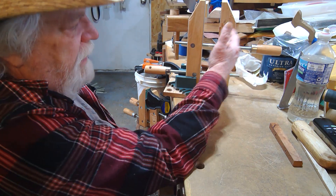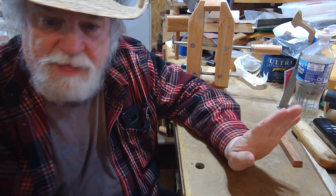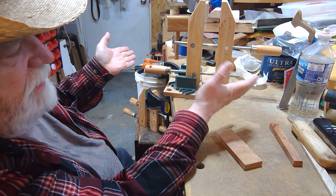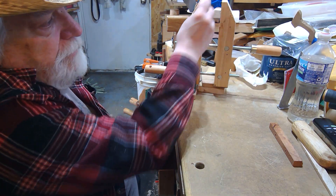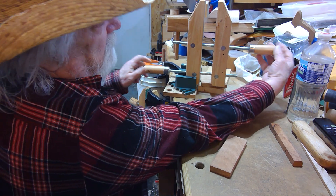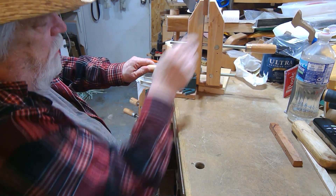Remember the two-step decision: before you move your knobs, ask yourself - am I adjusting my jaw, in which case turn them both the same direction? Or am I just tightening and loosening the object in the clamp? If I want to close it, righty-tighty means this knob turns that way, so the other one follows in that same direction. Instantly I can adjust to exactly where I want it, pretty much parallel, then put the piece in and go righty-tighty.